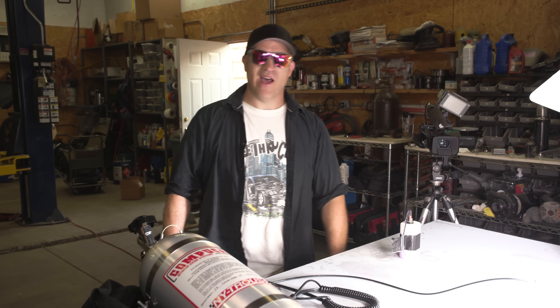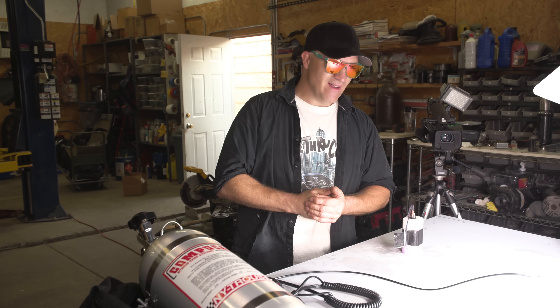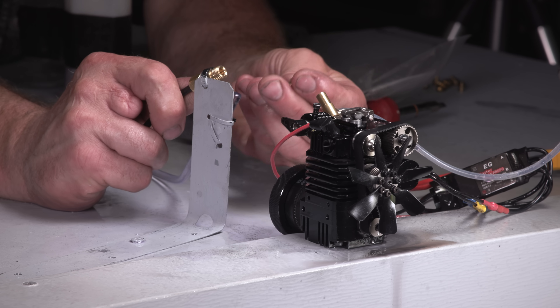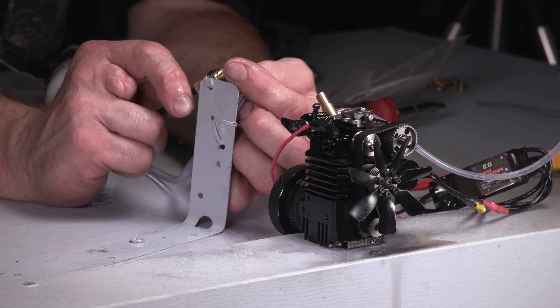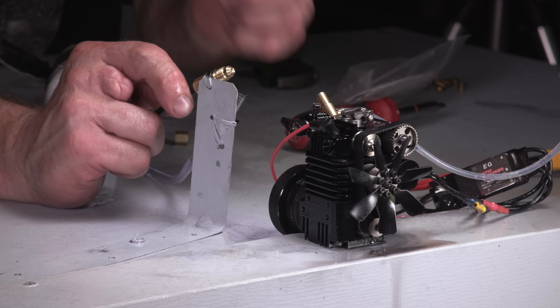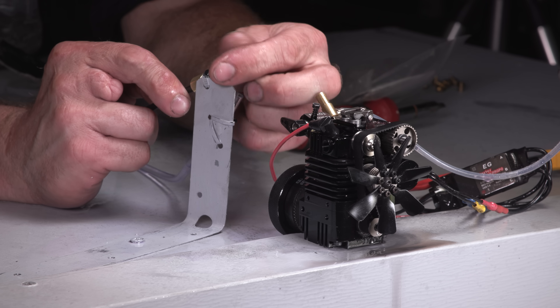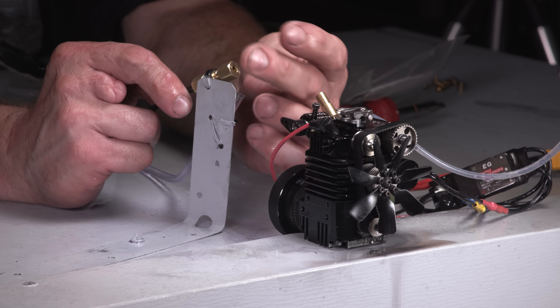I have the high-speed camera ready, so I'm gonna put a larger jet in here and try it one more time. Maybe I'll do another episode with oxygen-acetylene through this thing. For this I'm going to go with a size 32 orifice, which is double the size of the 16 that I just used. I think we're gonna see a lot of nitrous spray this time.